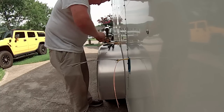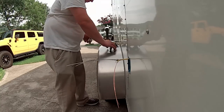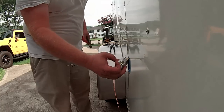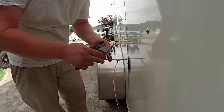In this case, we're going to back-feed two 15-amp circuits, so I'm going to disconnect that bar. It's a 15-amp device — there's the little bar right there — and now that you've disconnected it, you've got two independent 15-amp inputs, just like that.